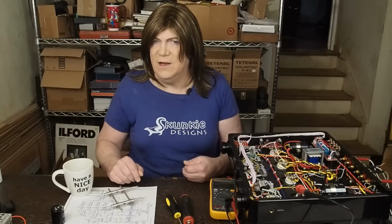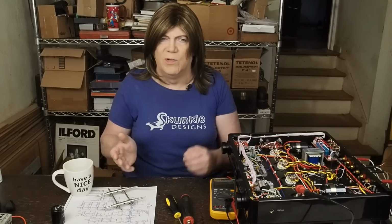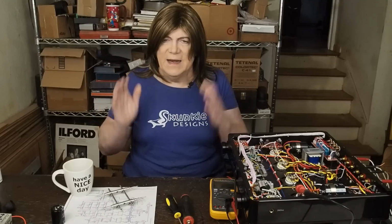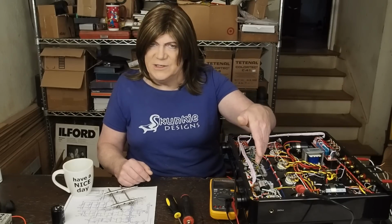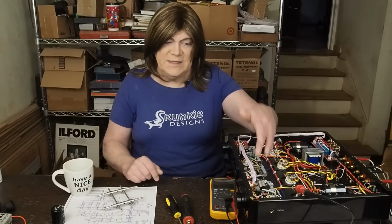I don't know about you guys, I've had a hard time finding a really good schematic of this amp. There's one real blurry one that I found on stereo.net that you can't read any of the values of, and then I've seen some hand-drawn ones, and neither of those that I found matches what's inside the amp. For one thing, the voltage regulator tube is not in series. The two triodes are not in series. They're parallel, at least in this newest version of this amp that I've got.